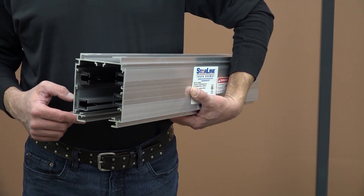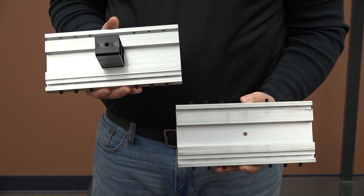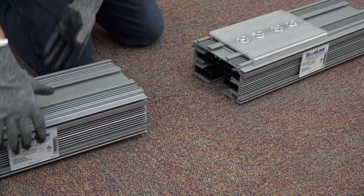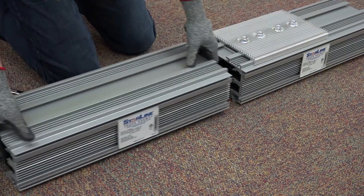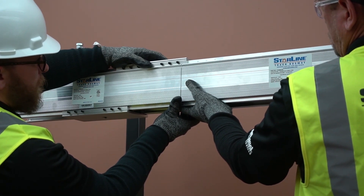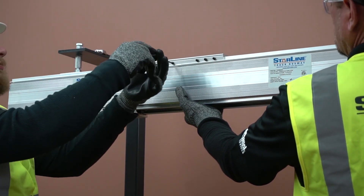When hanging the system, be sure to match each section to that of the adjacent section using the polarizing strip. Locate the housing couplers — these are used to join the busway sections. Ensure that the housing couplers are aligned before inserting them. Position the bottom one away from the joint. Insert a pair of housing couplers onto the housing. Align the busway with the adjacent busway section, then center the top housing coupler around the joint and tighten the set screws or bolts securely.